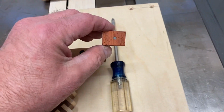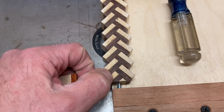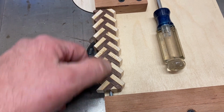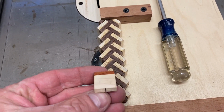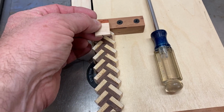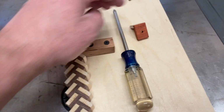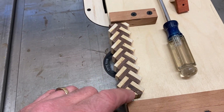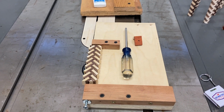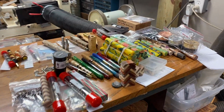This is a little jig that I made for a 3/4 inch blank. This one's upside down so you can't see it, but I find the center, and you've got to kind of watch on a herringbone where the center's at. You find the center, and there's your little line there. That would lay on the blank right next to the center line. And then I can take my punch, stick it through that hole, punch it, and that gives me the perfect center marks for using on the jig and for putting on the lathe to be able to perfectly true my blanks every time.